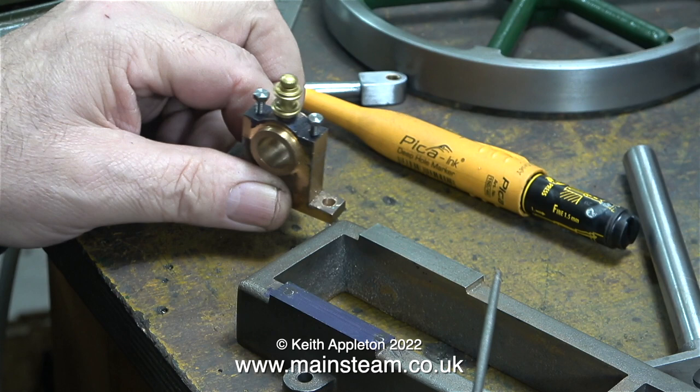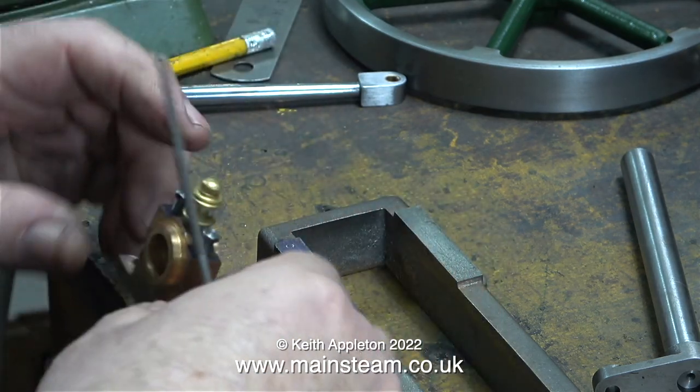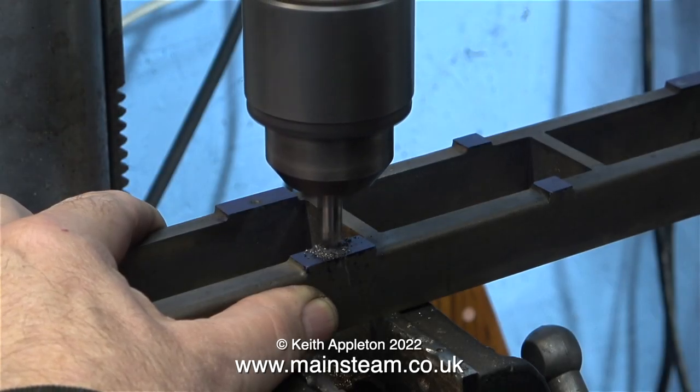Once I've finished marking the cylinder positions, I also mark the position of the main bearing that goes on the bed plate. In an ideal world this is a zero-tolerance job — the clearances on the holes are just enough to clear the bolts.